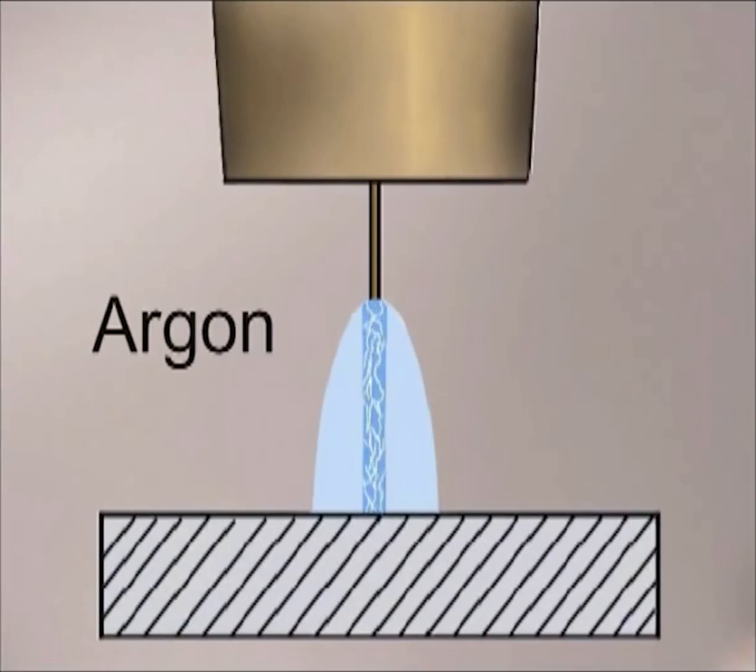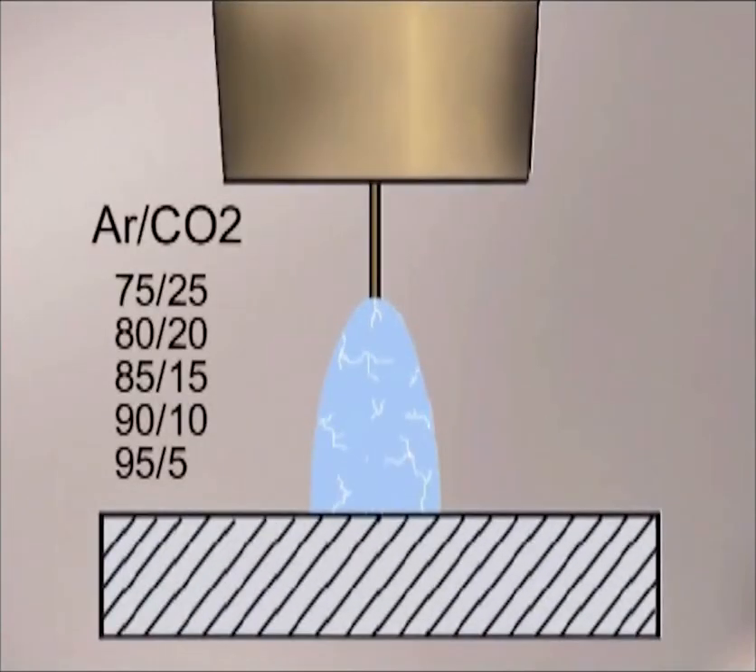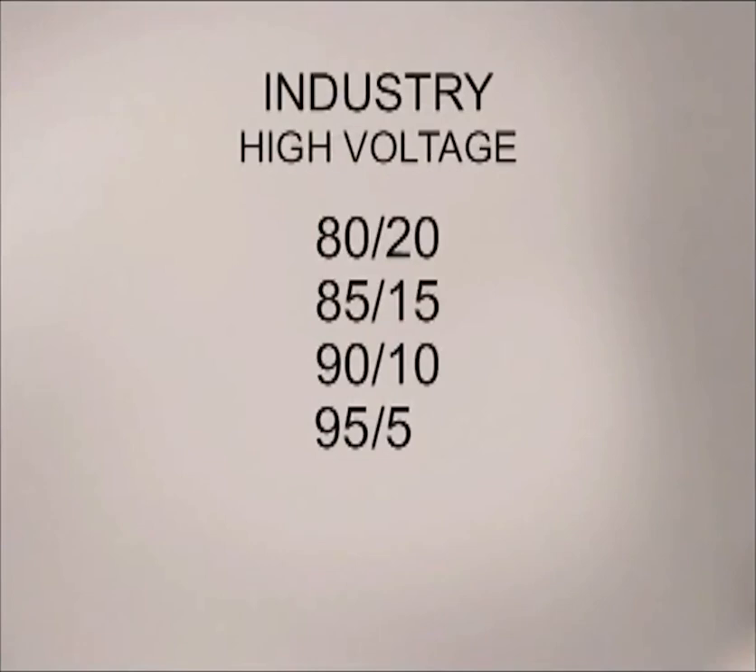While all that arc energy does help to produce a strong weld, the problem with straight carbon dioxide is that it just isn't any fun to weld with. The high voltage and arc energy causes a harsh arc that creates more weld spatter and agitates the weld puddle, making it difficult to control. Pure argon, on the other hand, transfers current extremely well. Requiring less voltage, argon produces a narrow, dense arc stream with very little energy. On carbon steel, welds made with pure argon would penetrate in the center, but the filler metal would not fuse along the sides. Carbon dioxide is mixed with argon in varying amounts to provide sufficient arc energy at lower voltages.